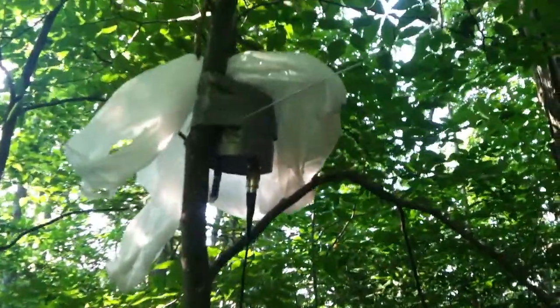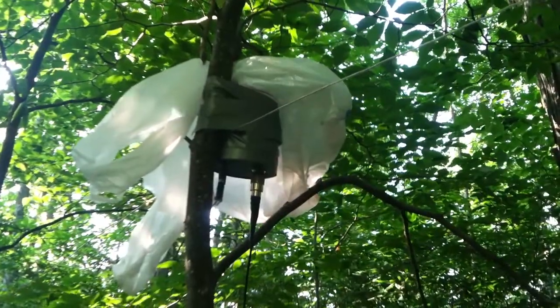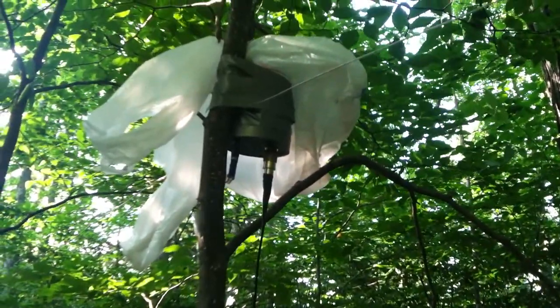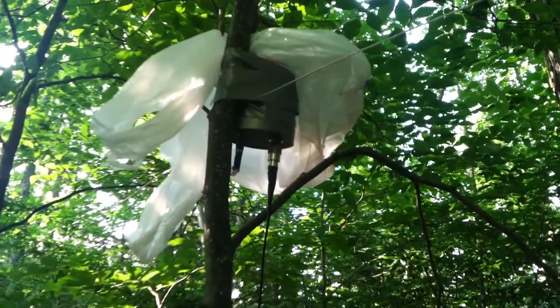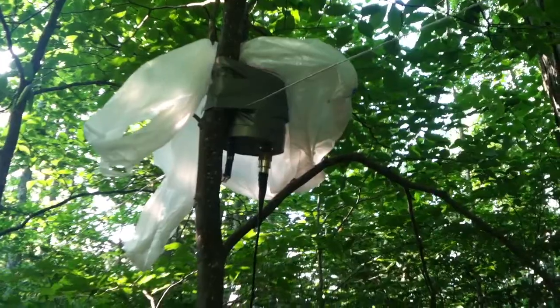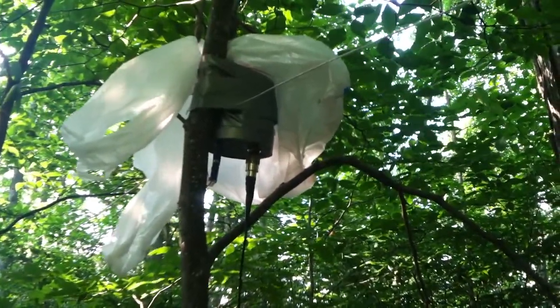This is my 2014 Michigan trip antenna. Last year I was able to use a 25-foot vertical up in a white pine tree. This year there were no pine trees or trees easy to climb, so basically what I have is a 50-foot long electrically short dipole, which is non-directional. It has two wires — 25 feet on each side of the matching transformer.